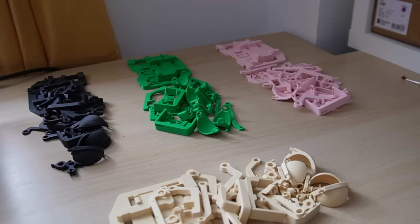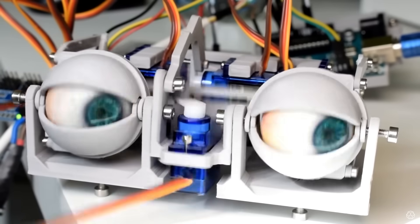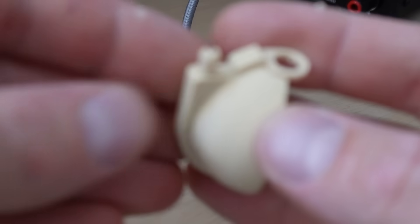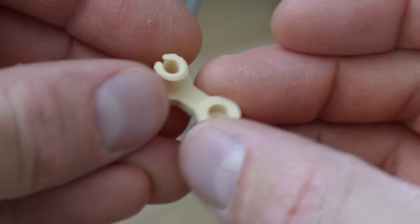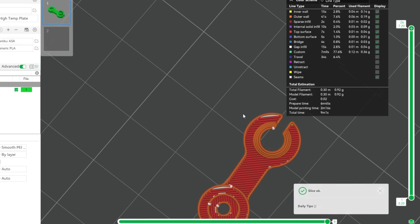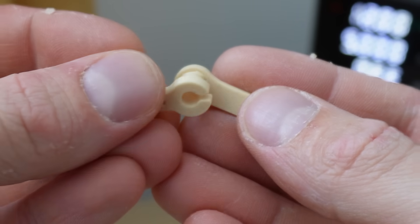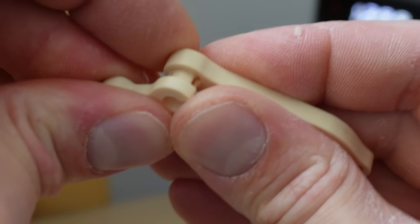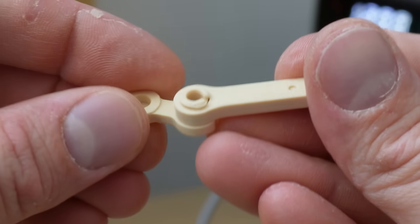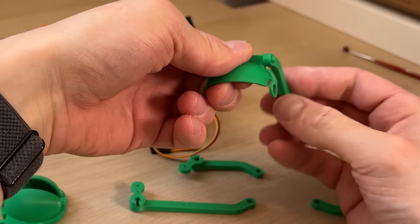My unique requirement was that in the previous design, a lot of the fasteners were actually being used as pivot points. This meant that in order to keep the flexion in the strong plane, I needed to print my snap-fit pivots as narrow vertical towers, which do suffer when it comes to laterally applied forces, because the layers can delaminate and the part can fail. But printing this way is also pretty important for a hinge, because by making your circles parallel to the print bed, you also get much more round holes and rods, which make for much better pivot points. The design I ended up settling on was a kind of hollow pin with a cutout — a C-shape which deforms just enough to snap in place, but maintains a nice circular pivot too. In some places this is smaller than others, and it's probably just approaching the limit of what I could make work with a 3D printed part, but it seems to actually work great.